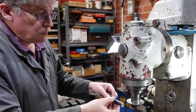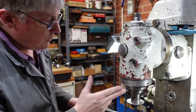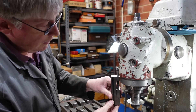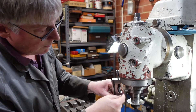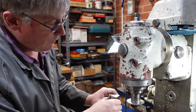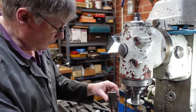We want to think about what size material we want to hold. Earlier I was saying about current vices not clearing the head — this is about a 70 mm slitting saw, pretty typical. With my smallest vice I can't get in there — not even close. So anything I have can't stick up more than about that much. On the other hand, it'd be nice to have this as low as I can, but if I could turn that around and mount it like that, I might be on to something. The downside of course is rigidity has diminished.